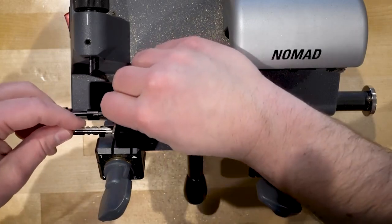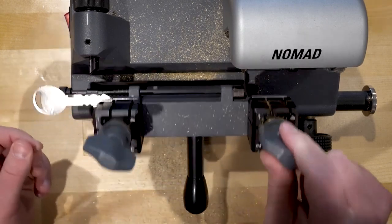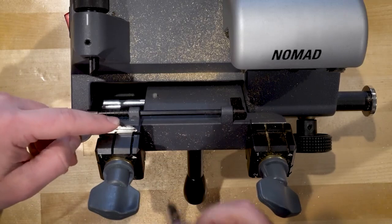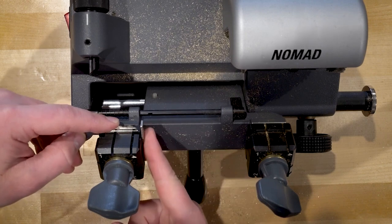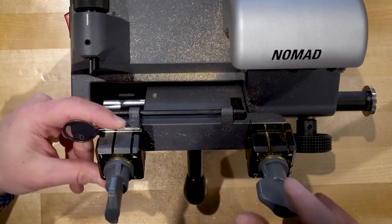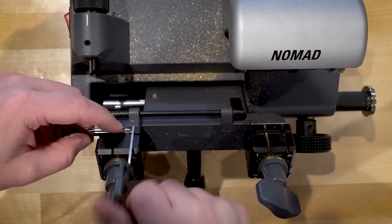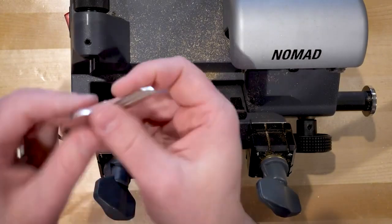You want to make sure you get as much of the key as possible on the jaw so there's enough material to clamp. You have two options for clamping — if you use the wrong option, as you can see, it's not going to work — that's a recipe for disaster. You always want to use the furthest-away position to clamp it down. Sometimes if I'm a little leery, I'll take this little gauge stop and run it in on both sides to get maximum meat on the bone. For this example, we'll back it off to the slot, put the key in, hold it down, and clamp it nice and tight.